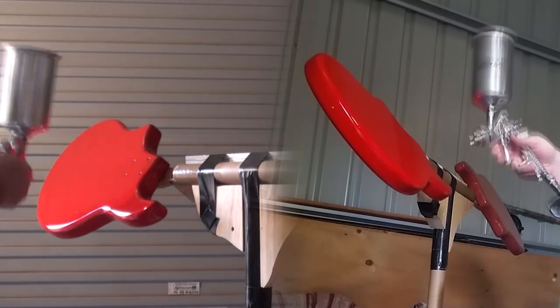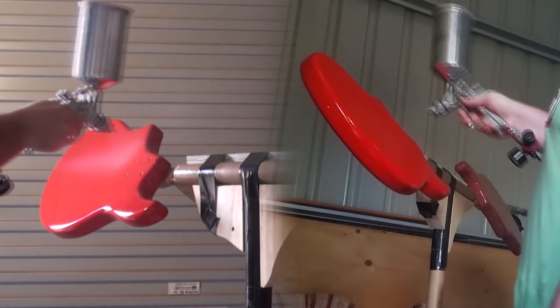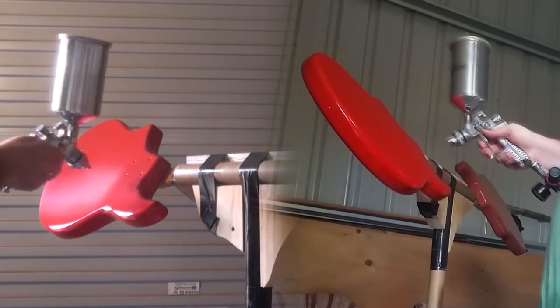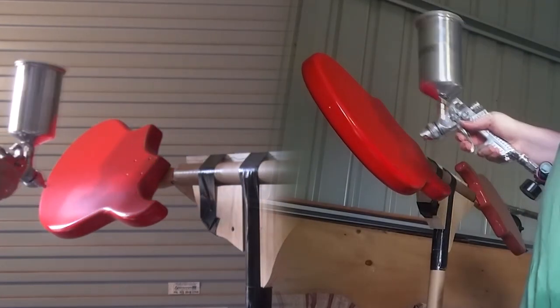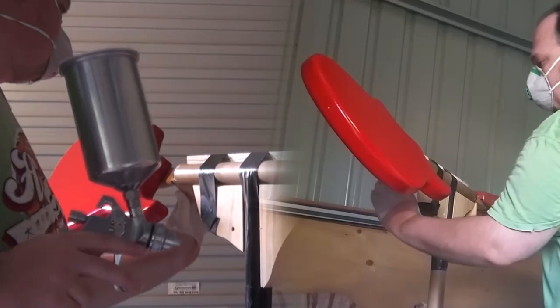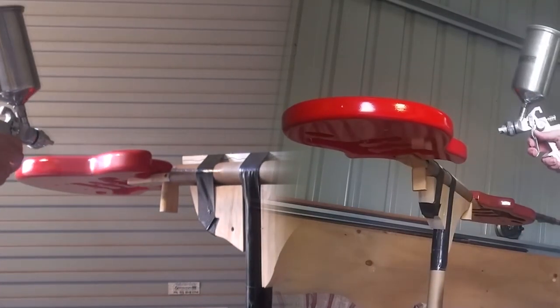Also, in the area where I sunk screws into the body, after 8 months, I can now see some of the wood filler shape showing through the paint. If anything, I think the wood filler should have been left to set for at least a week before sanding back, as it seems to have either shrunk or expanded and can be seen under the surface.